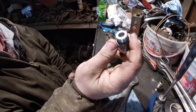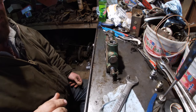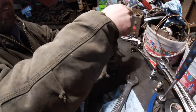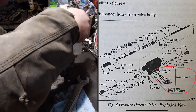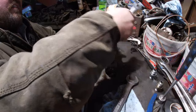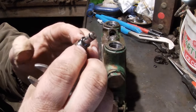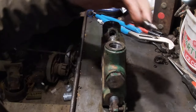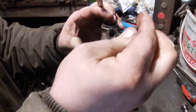The original had an o-ring elbow on it made into the hose, but I do these adapters and that works better. Now we'll take out our thermal relief valves. There were several different styles of these over the years, and there are two o-rings on each one. One started to come off — it's supposed to sit down in that clear groove there — but we need those off.